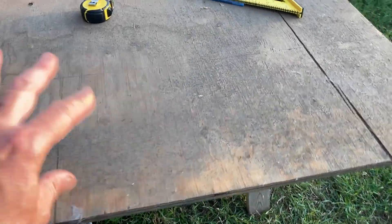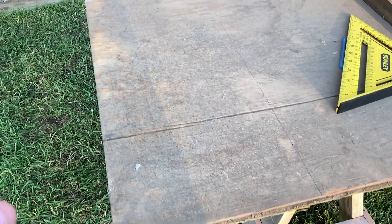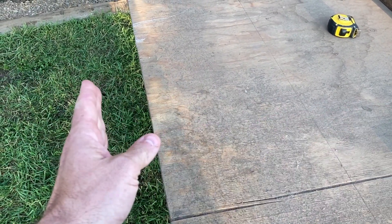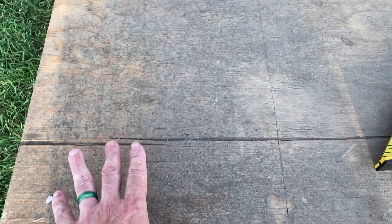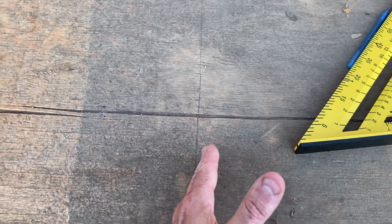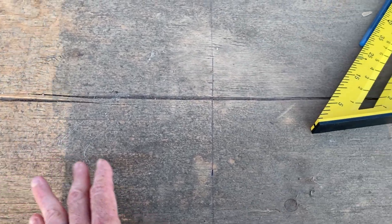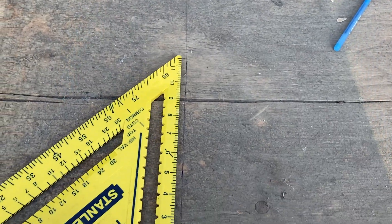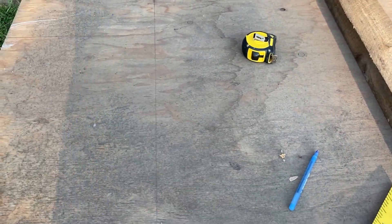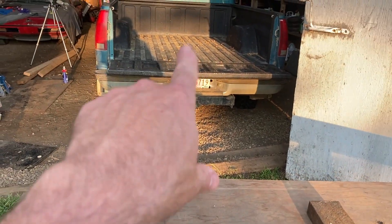I have my plywood on two sawhorses and I'm going to cut the four sides of my bale box. We're going with 14 inches being the depth and 18 inches being the width. I'm going to cut the two 14-inch sides exactly as wide as they need to be, then put the front and back of the box right up against them. I'll use a tape measure, measure the 14 over, square it around, use a little two by four to make my line, then grab my circular saw and cut — doing that twice to have two pieces.